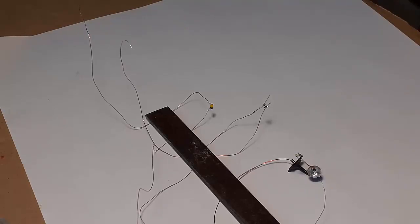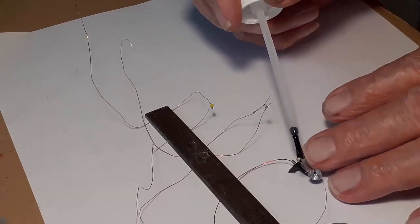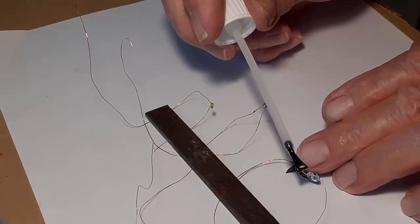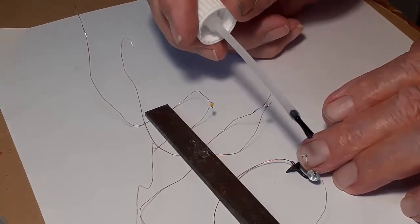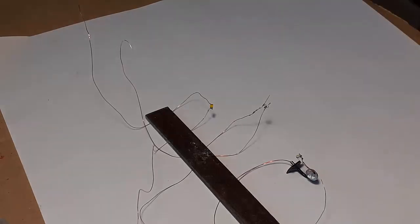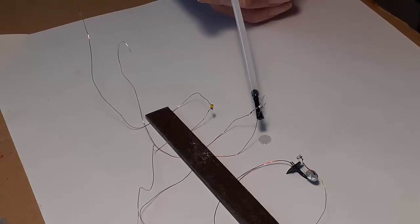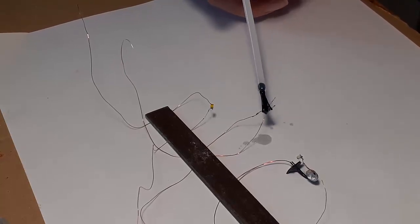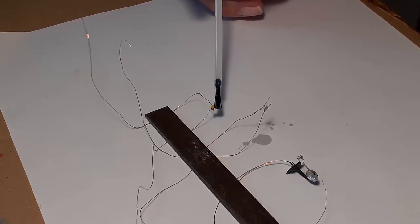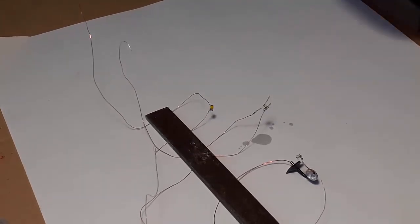Now for these lights I'm making, what I do is re-enamel everything — enamel the SMD LED and enamel those wires so you don't have to worry about them touching and shorting out. I just buy some enamel; you can actually use clear nail polish. So these will be put aside to dry, and once they dry I can use them.